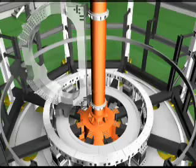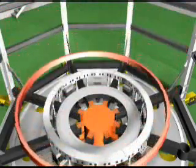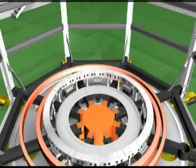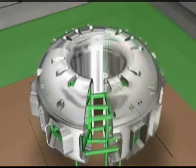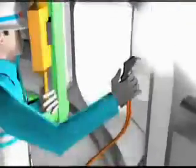After the performance test of the main jig has been completed, the main jig is partly removed and lower PF coils, PF6L and PF7L are temporarily positioned. While this happens, the 180 degree and 157.5 degree sector of the vacuum vessel are delivered to the site and welded to form a 337.5 degree sector in another place of the assembly hall.